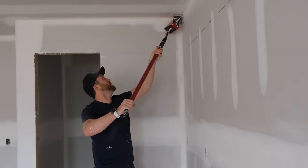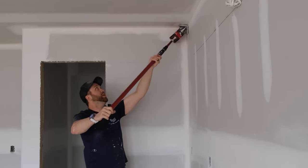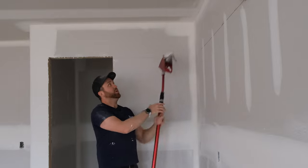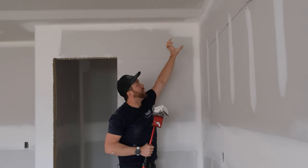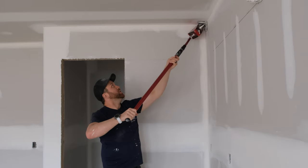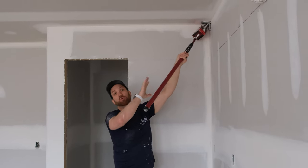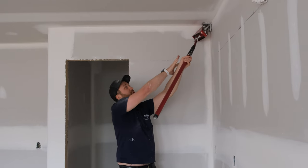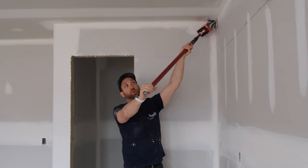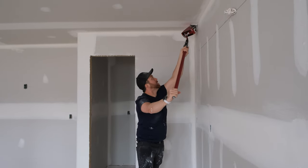Put this to the corner — you want to have this tool at 45 degrees from your inside corner. You don't want to be up here like this and you don't want to be down here like this. You want your corner finisher to sit perfectly square inside that 90-degree corner with your handle at 45 degrees. Once secure in place, you start pushing and move down the wall. Most of your strength is on this top arm pushing; this hand is mostly to direct where you're going.